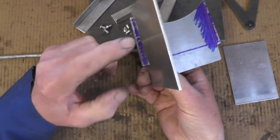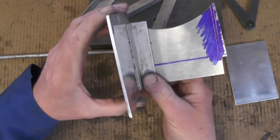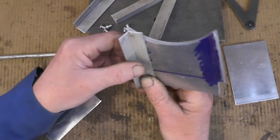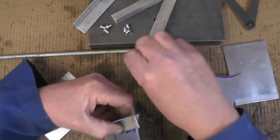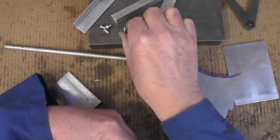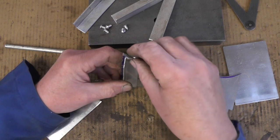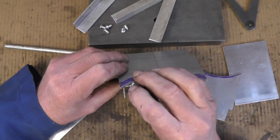Because it's going to be a box section, I can't rivet from the inside. So I've decided — I haven't got any aluminium rivets — I've got this bar here and I'm in the process of making some rivets. I'm going to rivet it with the head on the inside and then rivet and file it flush, so it pushes on the outside.